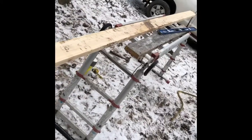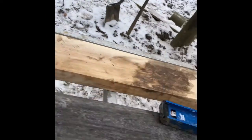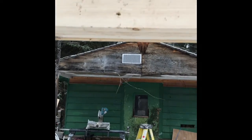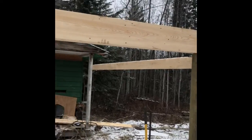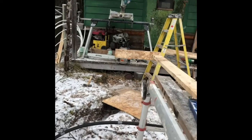So this here is the ridge pole. We've marked it out in 16-inch centers. The whole 16-foot pole, or ridge pole I guess you could say, is going to attach itself to that cabin there, and then on this side it will be attached to the same kind of setup as we have on this end.